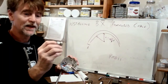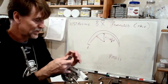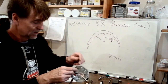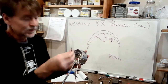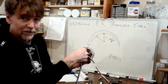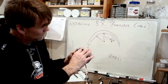Okay, so it's a 1/2 inch box connector is the official term, but we call it an L16. And you've seen these, I think, probably at the panels. When you put the wire in the panel, you probably go in securing that wire with an L16. So the connector goes on the outside, the lock nut goes on the inside. You've got to put some effort into making sure that this doesn't get cross-threaded. Once it's started, you can spin it on there fairly quickly.